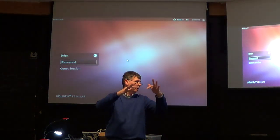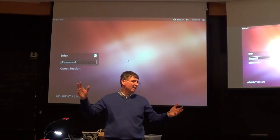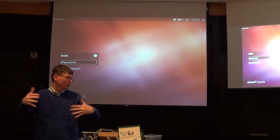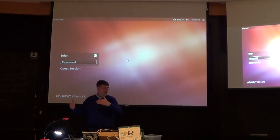So what you do is you calibrate for the fact that this button defaults to high. The proximity sensor might give a number from 0 to 1900, and it might not be a linear scale, so you need some computational algorithm that tells you a meaningful number. That's what you calibrate. The digital ports are zeros or ones, and you set them up to be read from or written to. That's part of your setup sketch. You specify the pin and what it should do. With analog, they typically are read and write, and you can write a range of numbers or read whatever the sensor is programmed to give you, and then you have to make sense of it. Does that sort of explain it?